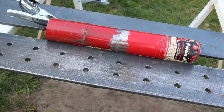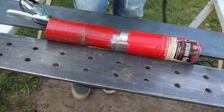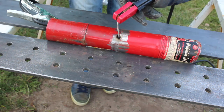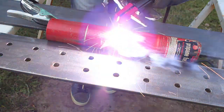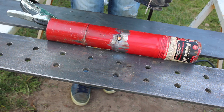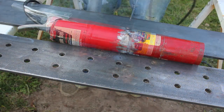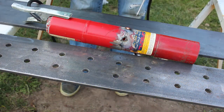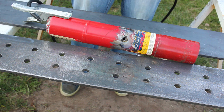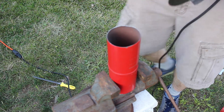After cleaning and prepping the propane tanks, I used a similar setup to before to hold them in place. The sawhorses and slabs of bar stock make an excellent portable welding table. I'm using 7014 electrode again, though 6013 may have been a better choice for this job since these tanks are pretty thin. Things went well at first, but then I let the puddle get a bit too hot, my travel speed was too slow, and I blew through the material in a couple places. Luckily, no big deal — those little holes aren't going to make much of a difference in performance.